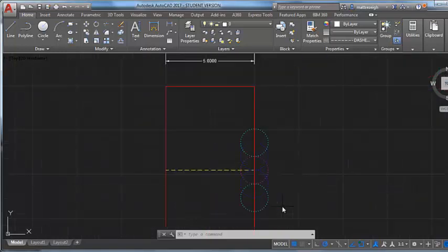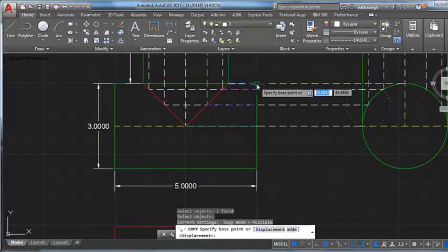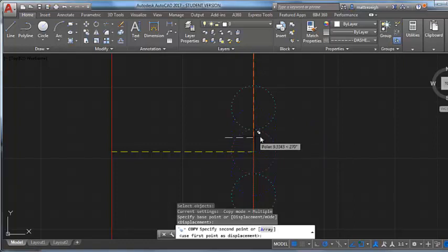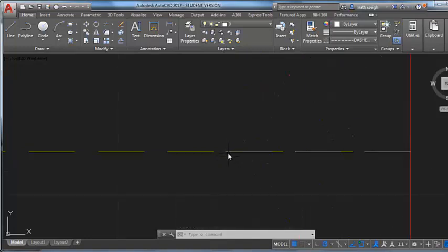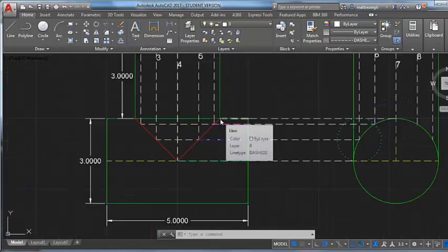So now bear with me a little bit, but I'm ready to take this information and put it down here on my header line. So I told you I was going to put my yellow center line. I'm actually going to say that is my 12 o'clock line, which over my right side view is a white line. So I copy this from the end of the header, and that is where I started taking information from, right there. So it's going to sit right on top of that yellow center line, but it's only that little short length of a line right there. That has now defined this point. That little point is where that branch starts in the header.